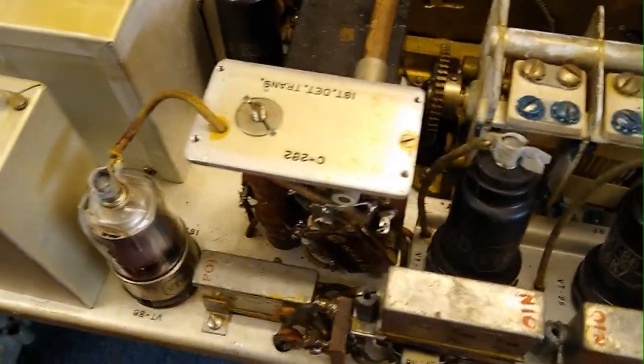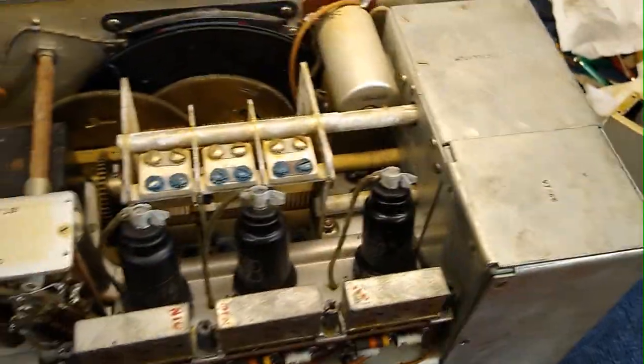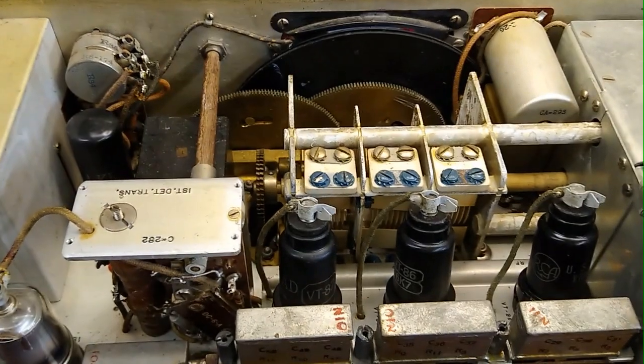I can demonstrate it by creating a short circuit here. I'll short circuit the power line to the radio. You see what happens? Instead of blowing fuses or tripping circuit breakers, this bulb takes the current. Okay, now, there we are. We can hear a short wave station.